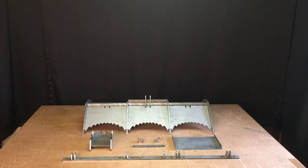Here are the components of the grapple dry fit together. Overall everything went together very well considering these are one-off prototypes. We'll now move it to the welding table and tack it in place, then we can place it on the moldboard conversion kit and see how it fits.